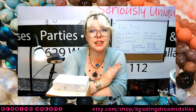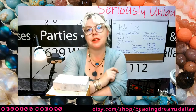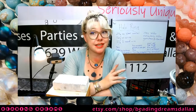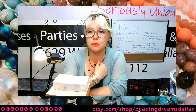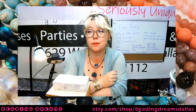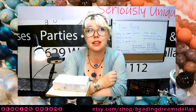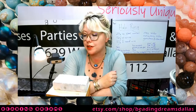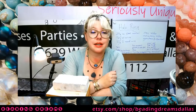Number two, once you've had a flame going in your workspace, from that point forward assume that everything in your workspace is hot enough to burn you, because a lot of it is, even if it doesn't look like it. Number three, ventilation is important. If you find yourself feeling uncomfortable in the lung area after you've been soldering, listen to that. You may need to re-examine your ventilation situation. You may need to go by a window, install a vent hood, or go outside. There are chemicals being burned off during this process that bother some people more than others, so make sure you listen to what your body is trying to tell you.